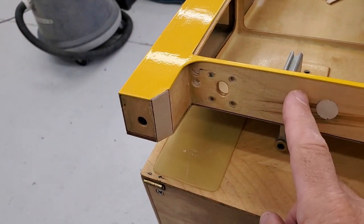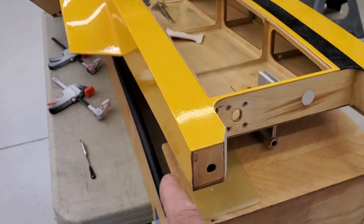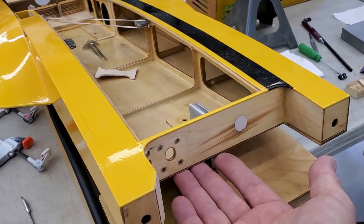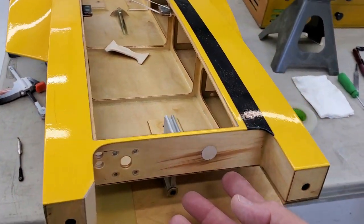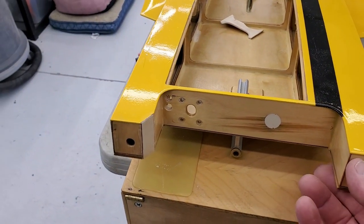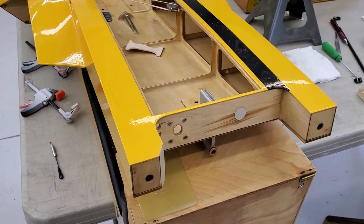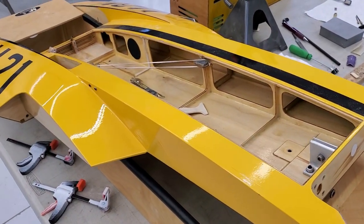On the full-size boat, the real hydroplane, this was all just bare wood, coated but wood-colored — not painted. The whole bottom too. So you save a ton in money on paint as well as in weight, because otherwise you're filling it, then priming, then painting. And it looks great. Okay, so what we're doing next — I've already taped underneath here. Remember, this is our pipe mount. I just laid a piece of tape underneath it, and I actually drilled this out slightly so I have rough wood edges that'll allow the epoxy to seal on it really well.